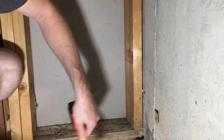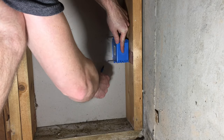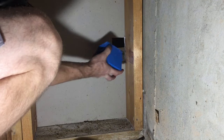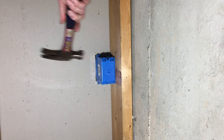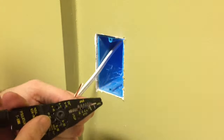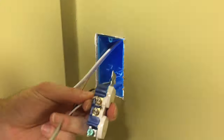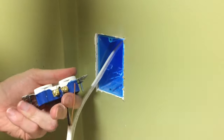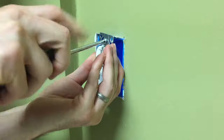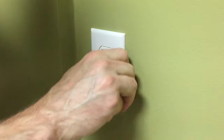I decided to first get the electrical outlets in place. I needed two outlets — one on the floor for the entertainment center, and one for the projector. First up is the one on the floor for the entertainment center. I removed the drywall from the back side of the wall to allow access, then measured and marked the correct height for the outlet, cut a hole, installed a box, and nailed it to the stud. Next, I wired up an outlet: the white neutral wire goes to the silver terminal, the black hot wire goes to the gold terminal, and the bare wire goes to the ground. Screw it in, install the cover plate, and we are all set.